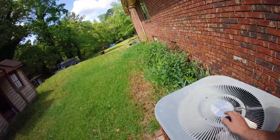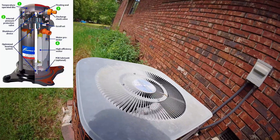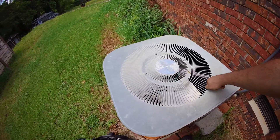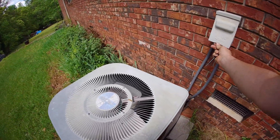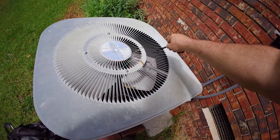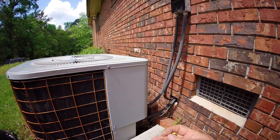It definitely turned on but we are not seeing any fan rotation whatsoever. That sound is the system in a bypass where the compressor is bypassed internally due to pressure buildup from the fan not operating. We'll take our handy dandy tool and try to tap the fan motor — that thing is hard locked. We just disconnected high voltage power. We can tap it now and it spins freely, however when power is applied and we tap it, it doesn't go either direction — it's a locked rotor.